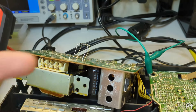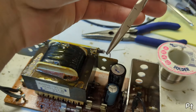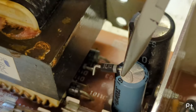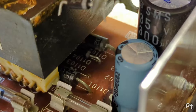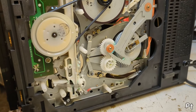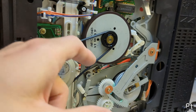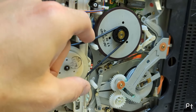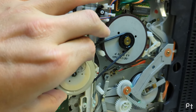These are proper rectifying diodes. I'm probably not going to keep this thing, but I'd rather put the correct components in than components I've salvaged from something - and these were like 20 cents each, so it just makes sense. For actually properly installing these diodes, I'm pre-cutting them and then placing them in with some needle nose pliers because they have to kind of go under the transformer. There, done. I'm just putting it back together and figured I'd take a look underneath - everything looks to be in good shape. This belt is remarkably in good shape; it's got a bit of stretch to it but if I spin both sides it's got a lot of torque, so it's fine.